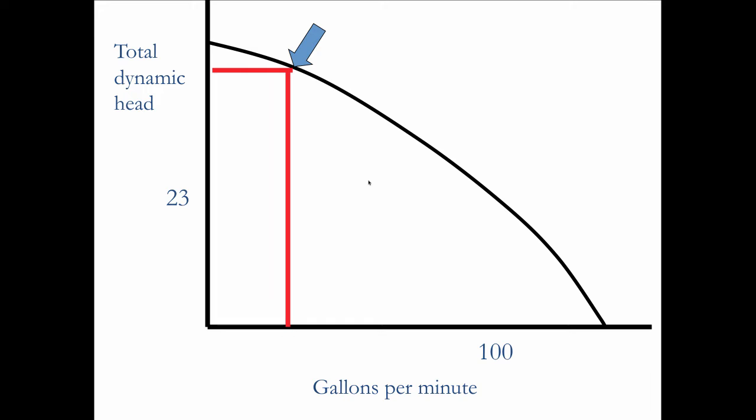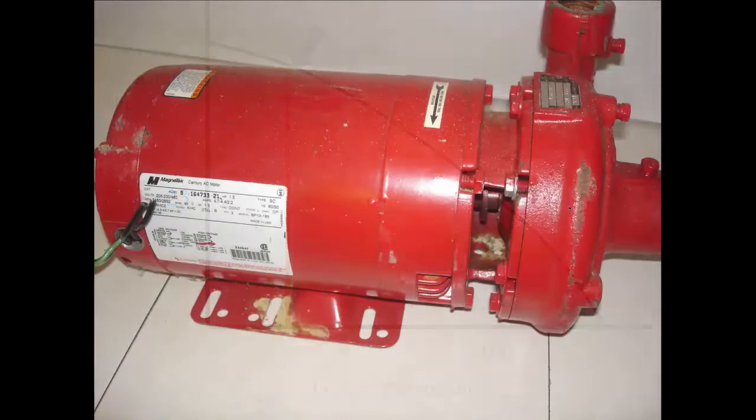All of this is cured in modern times by smart pumps that have ECM motors on them, because the pump will just automatically find itself anywhere in this slice of pie here. It'll just drift around until it finds exactly what you need, and it'll do that without building pressure. So that's modern times. But this is a single speed circulator.